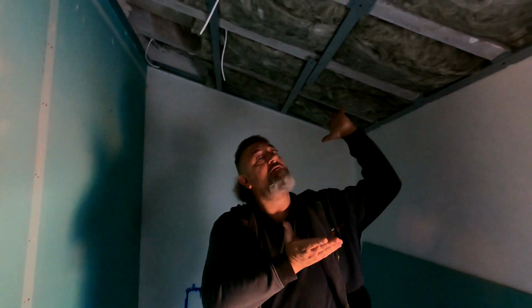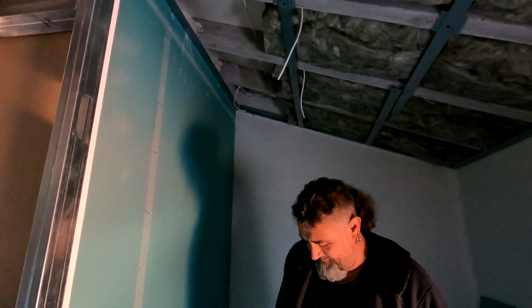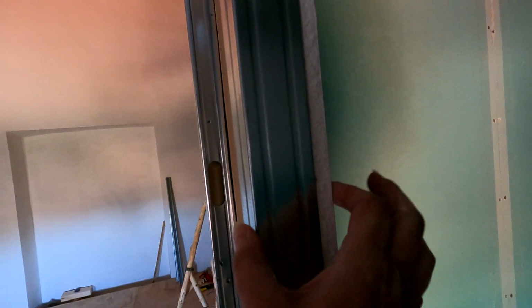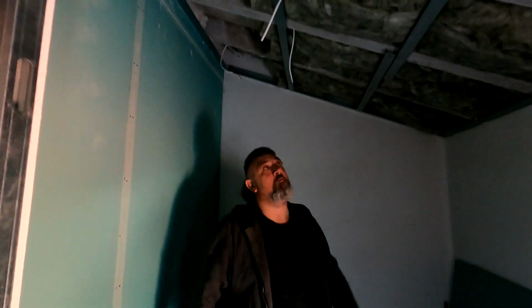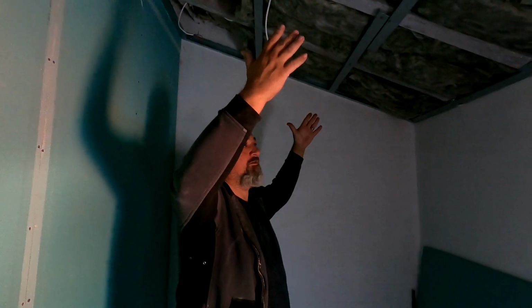So there you go. Insulation. Yeah, we've run out though. It's not the insulation, it's because the roof's thick. We allowed for this amount of insulation, like the rest of the walls that we've put up. Unfortunately, the distance between the new ceiling and the old ceiling is triple that, but we did allow double. We'll have enough, and it wasn't. We should have measured it and thought about it better. And it's triple. So all we can do is put this board up. We'll get it to there.